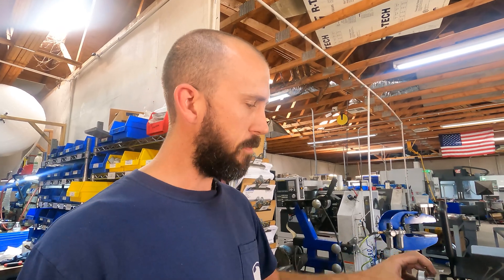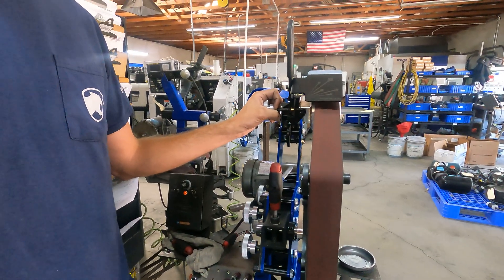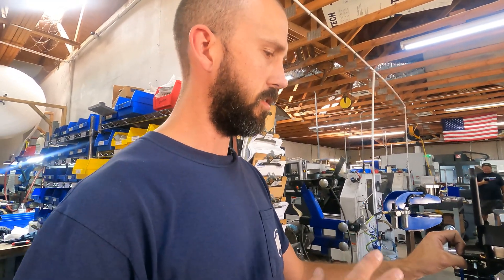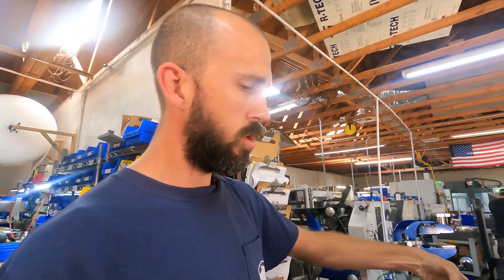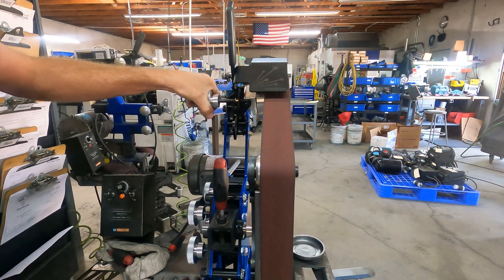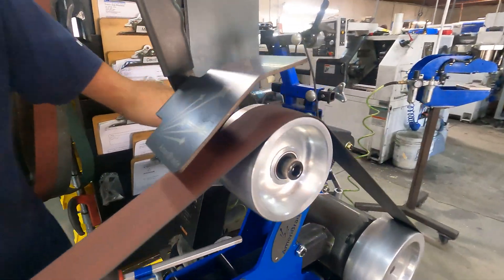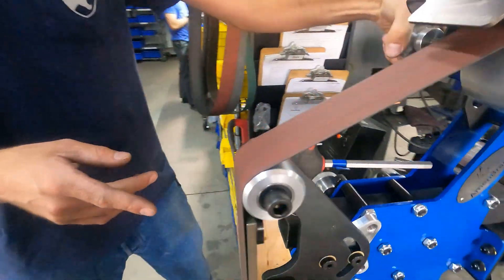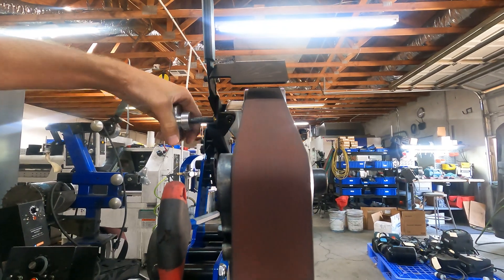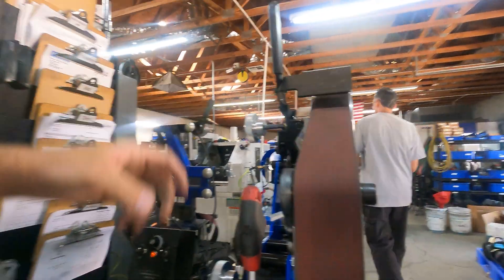The problem is a lot of people go right back up to the tracking knob on top of their tracking wheel — understandably — but that is not an effective method for tracking the belt in reverse. As I crank really hard, the wheel gets way leaned and it's not responding well up front for the amount of input I'm having to put in. It's putting my wheels at extreme angles that are going to wear out my crowns prematurely.